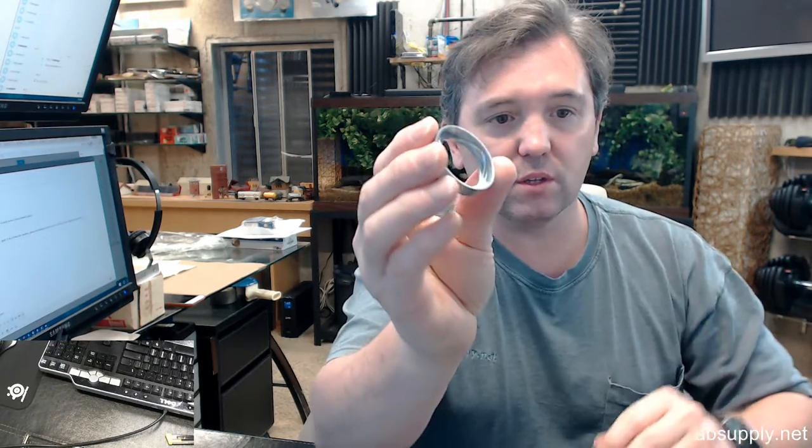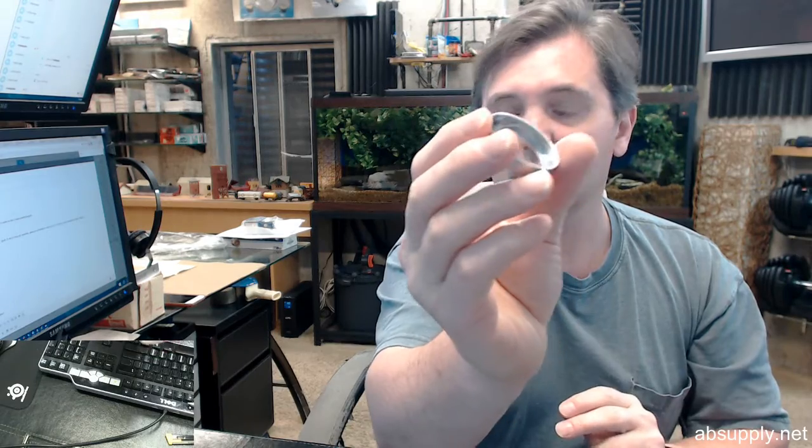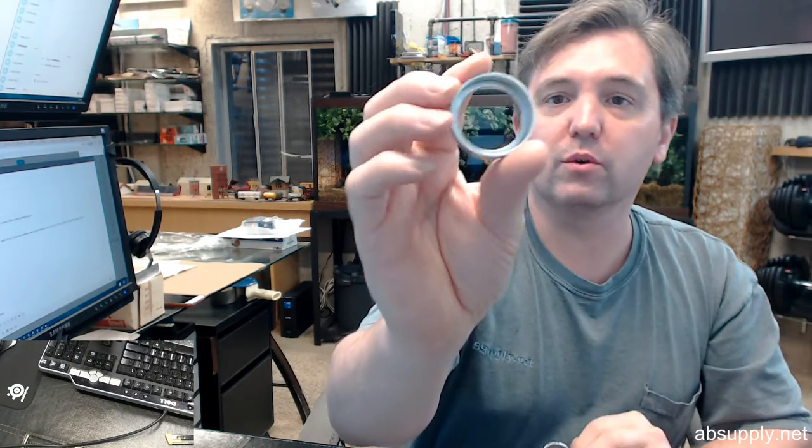Moving forward, it's going to include a wave washer. You can see kind of why they would call it a wave washer. And obviously this is intended to have your mortise cylinder go in through this side, be able to thread it down so that you have the cylinder ring tight to the face of the door via the wave washer. This will basically allow you to insert the cylinder so that the head of the cylinder is flush with the outside face. And this sort of inverted collar is going to be very typically seen in mortise lock installations.